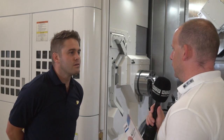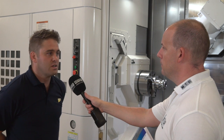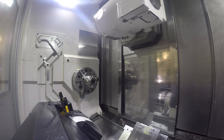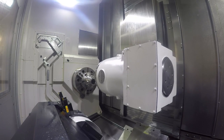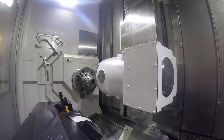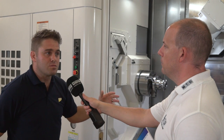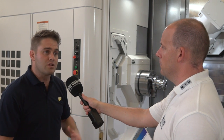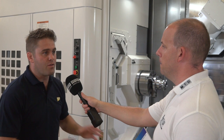And then onto another point — 5-axis auto-tuning. This is an onboard system. You will have geometric errors in your machine that stack up over time, so every axis has got its own geometric tolerance. Over time these will change due to your floor and certain different things. So when it's shipped from Japan and arrives at the customer's premises, once you check that machine there are some slight geometric differences. This 5-axis auto-tuning can then fine-tune the system and bring it all back in line so it's a very accurate machine.